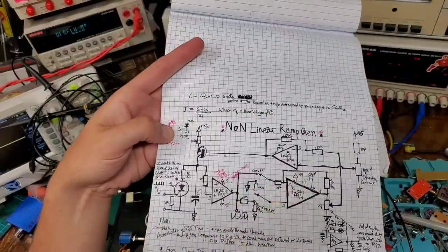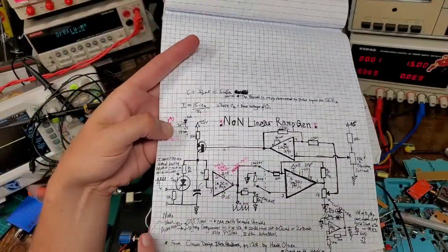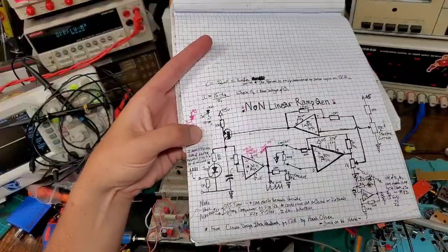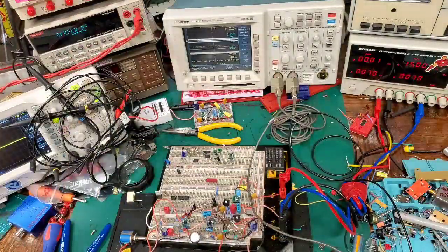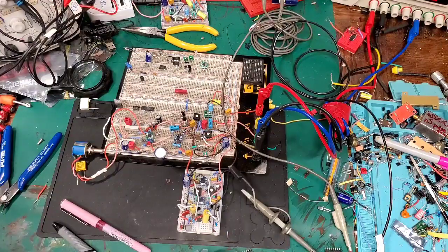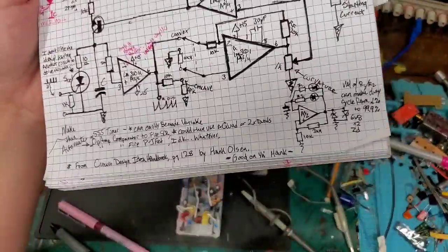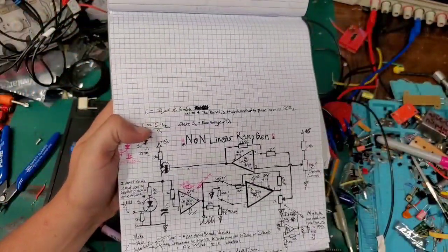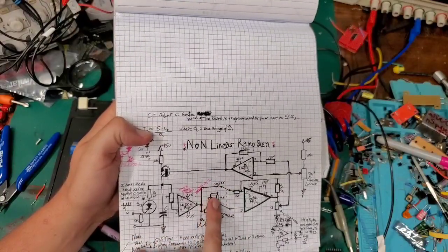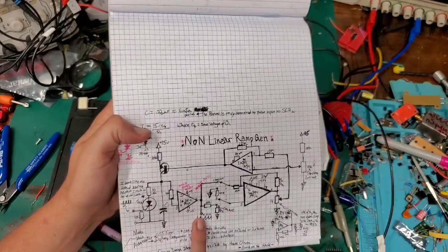So the 15k goes straight to ground from the negative input of a 3/4, and the SCR is what's switching. I have a pulse driving the SCR that's coming from just a regular 555, a 7555 if you must know, and a couple dual amplifiers. That's a lie, one of those is single. So I just have this getting buffered. Nothing there because that's on the convex side. Don't care about that. Concave. There. Pulling output from there.